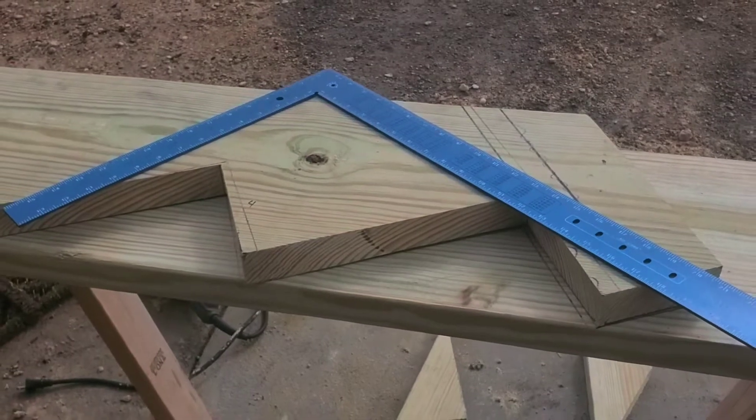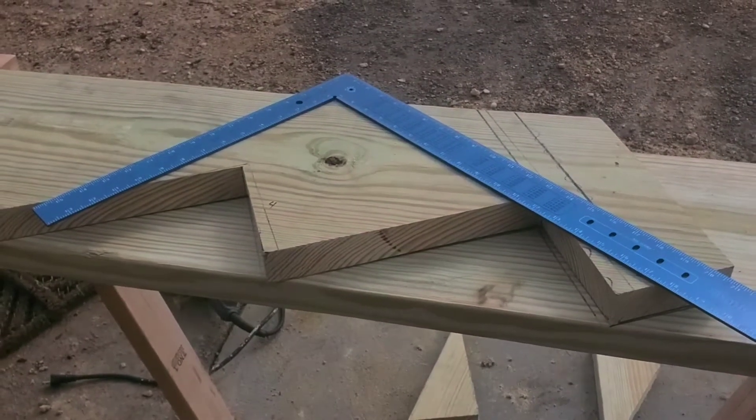I'm not gonna get into all the nitty-gritty fine-tuning of the measurements — there are plenty of videos out there for that. Essentially, the standard is seven inches of rise and eleven inches of run: 7-11, simple enough to remember if you decide you want to make your own steps rather than buying ones that never work for your exact circumstances at Home Depot.